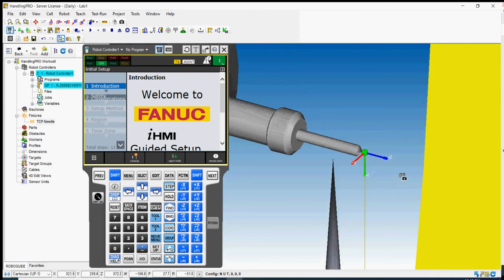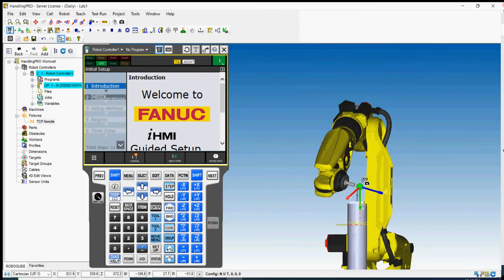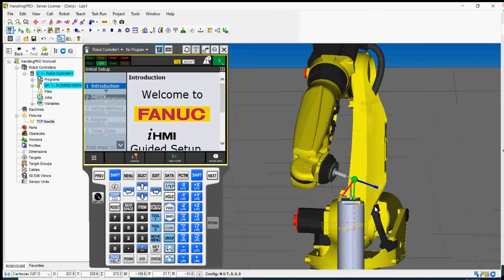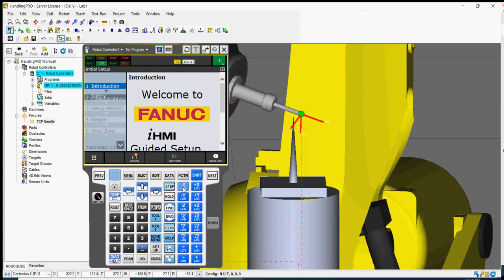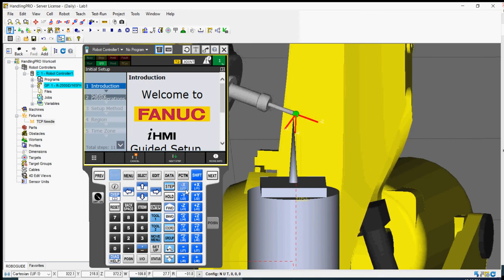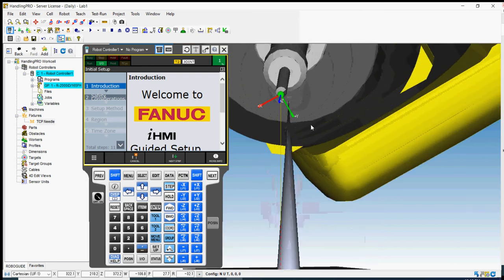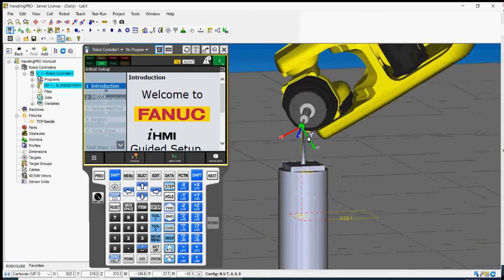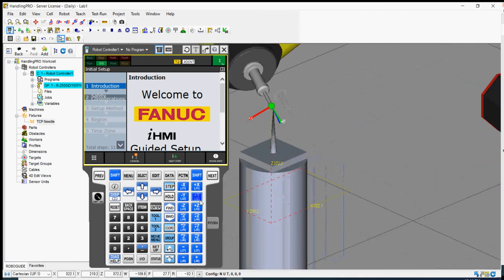Okay, so now we need to move it in. Probably, I need to rotate my base joint to get it in position. So base joint is one, and so we need to do joint one, J1, and get it slowly there, and it's kind of okay. So I'm going to stop there and do a quick rotate. So almost there. So you can see it takes a couple of tries before you get it. And so let me now move my joint number two.